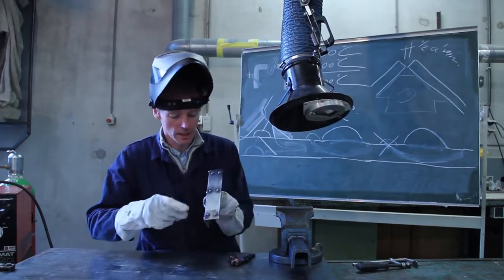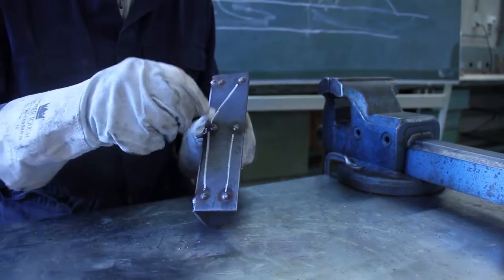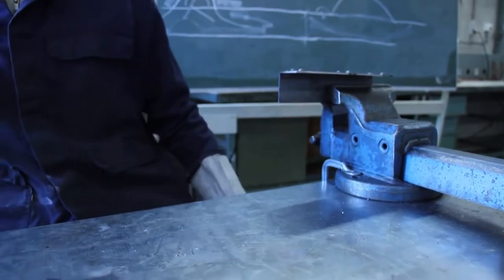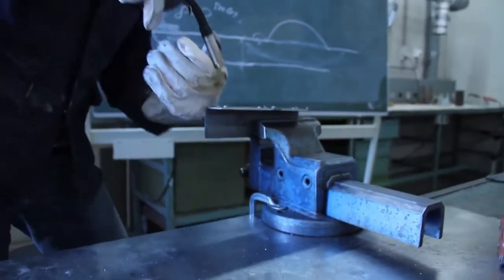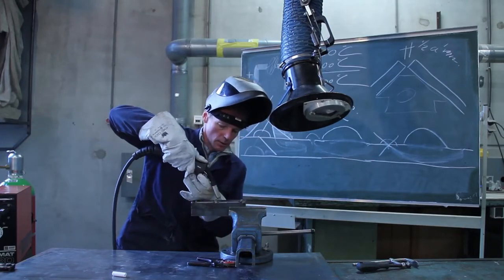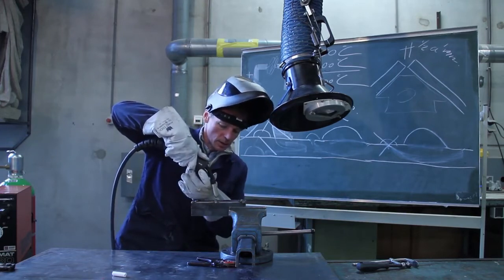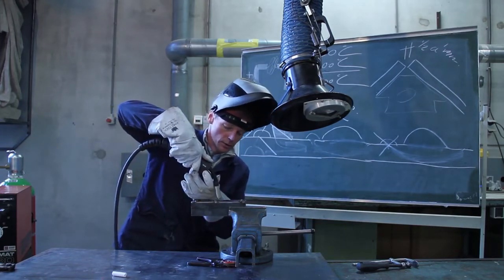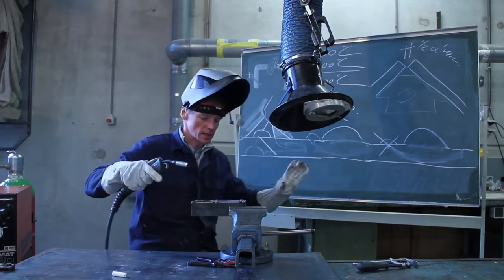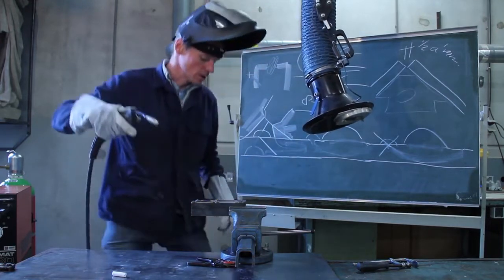Next thing you're going to learn is how to make some welding lines. So I want 4 lines. And what we're going to do is you put it in here, and which is really important is, again, that you have to hold your pistol in the right position, in the same angle, on the right distance. So don't go like this or like this. Try to hold it in this position. Don't even go too fast, because when you go too fast, you have the 1 second story. So it has absolutely no constructional value.